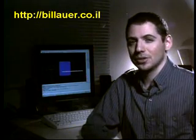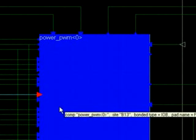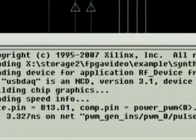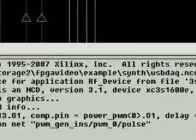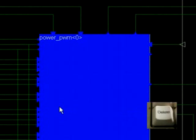This is important because what we want to do next is press delete in order to disconnect the net from the port. Another thing I'd like to draw your attention to is that some information about the net and the port appeared at the bottom window when I click the port. I always check this line just to be sure I'm not chopping the wrong pin. We've selected the port, we are sure it wasn't the net selected, so we won't delete the net. It's finally time to disconnect — just press the delete button.